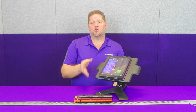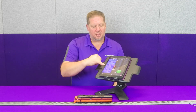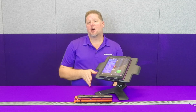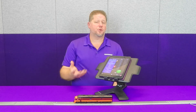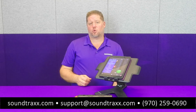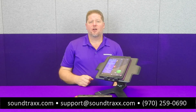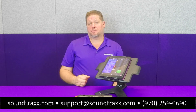Now with our Tsunami 2, and if you were using the BlueNAMI on your normal DCC system, the RPM plus and the RPM minus default to function five and six on the aftermarket decoders. On their decoders that are factory installed, the Tsunami 2 has those defaulted to functions 26 and 27 respectively. So be sure to check out the user's guide for more detailed information, and also check out the information card that comes with your decoders.